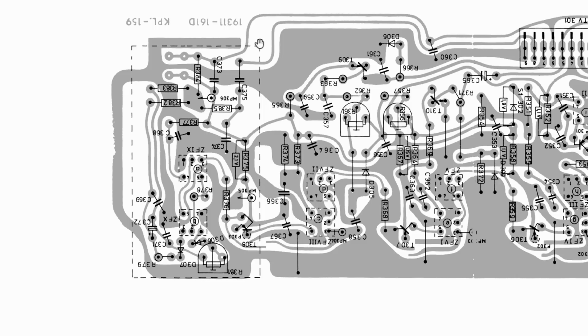I did not want to desolder the shield from here because the tuning would be off. So you have to sort of figure out where it is, and you can actually see it. If you look into that hole, you can see this pad is a particular shape. Now, once again, this is that light coupling. This is like a capacitive coupling pad.